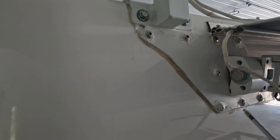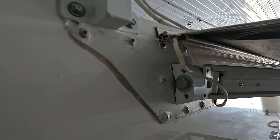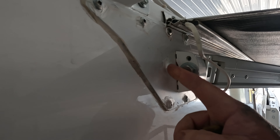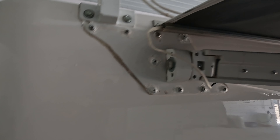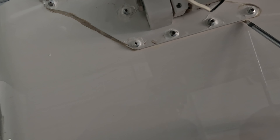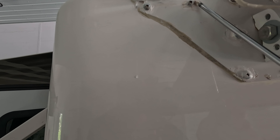They use stainless steel screws, but this is just a metal plate. What I noticed is some of the screws weren't flat - I should have took a picture before. The screw itself went in on an angle, so the head was at an angle. So every time it rained, water would actually just run down inside this plate and go behind this backing plate. I took it off the bottom, and as soon as I did that - this is before I washed everything - water was coming out from underneath the plate because it would get behind these screws. They didn't seal them - no rubber backing or anything. They just put the screws through this plate and drilled them in without paying attention.